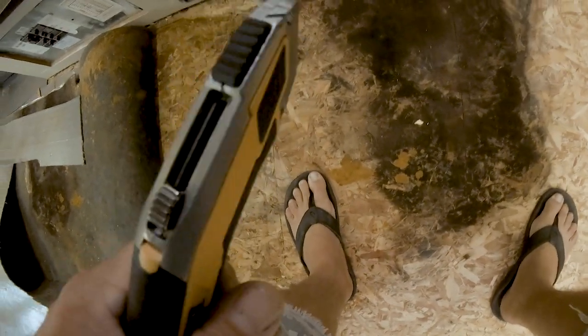Once they were all up, I started pulling out the underlayer and as I started getting into the bathroom area, I started noticing a dark area in the subfloor. Once I got up to the toilet area, then I knew we were in trouble. There was a lot of mold and moisture all over the subfloor.